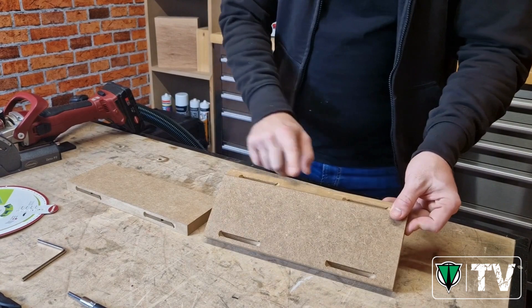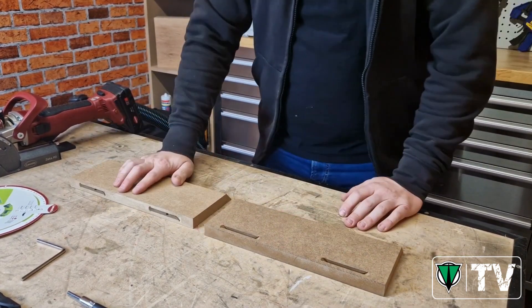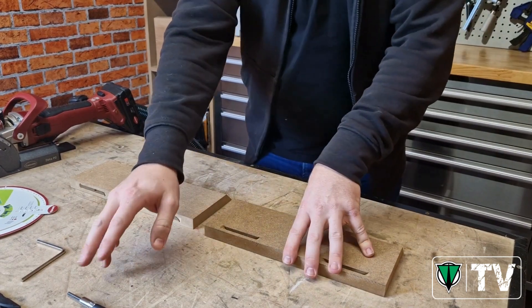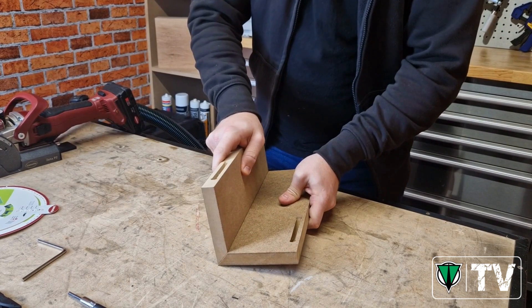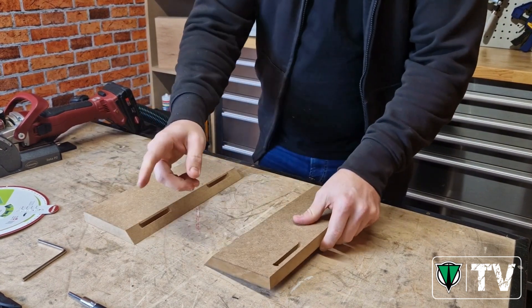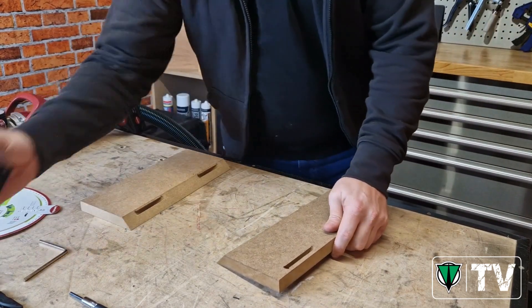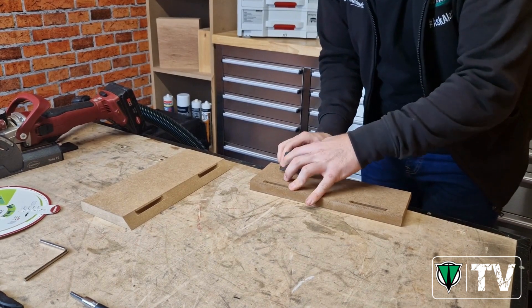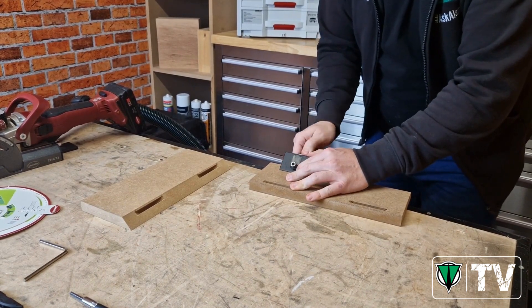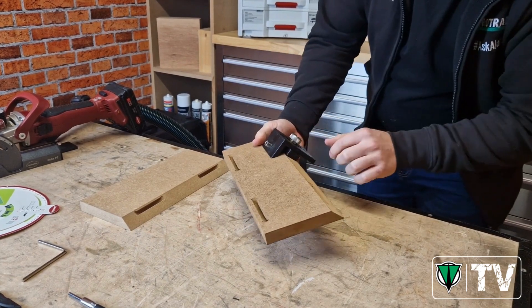So the slots are cut on the mitres. We go ahead and put the connectors in. First thing to remember with the Clamex though, we need to create the access hole. Our joints are going to be somewhat like this. I'm going to create the access holes just on the inside of this panel here. So we'll grab the drill jig, pop that into the cutout, and slide that down so it's nice and secure. Just twist that so it's perfectly on the material.